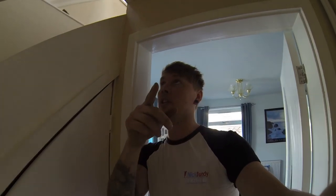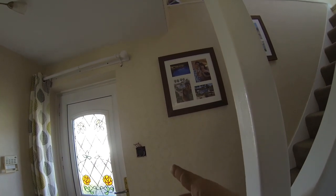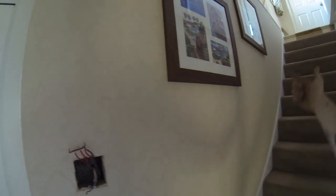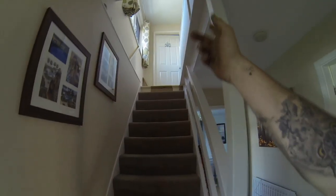I'm going to locate upstairs where all the switches are. The lounge switch will feed the master bedroom, one here for the landing, one for the second bedroom. I'll get the carpet up, locate the boards, pull them up. Also found that two-core cable wired into the 16-amp breaker — it's an outside light feed, gone straight into a connector block off the back and then into the switch. When I turned the downstairs lights off that was still live, which is a real safety issue. So I'll cut that off, run a new cable out, and bounce it straight to the outside light from the new feed.